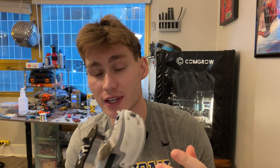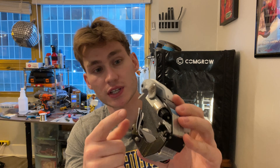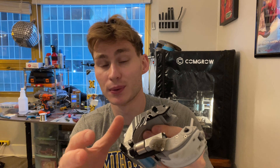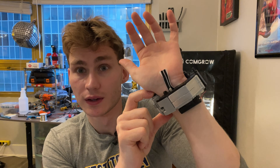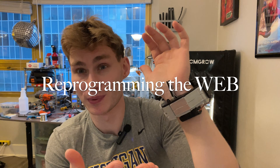Here you'll see we have most everything assembled from a mechanical and electrical standpoint. In terms of controlling this thing, we actually have two actuators now - one electric motor to activate the valve, just like we did before, and one electric motor on the back that retracts and deploys the trigger. What this is supposed to do when I turn it on is automatically perform a cycle of the valve motor to shut the valve, just in case it's open. But you'll see once I turn it on, it actually does a little retract on the trigger because I switched the motor ports around. So we're going to have to reprogram this thing.